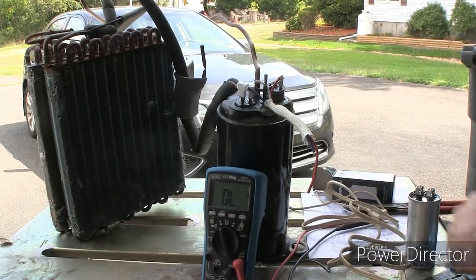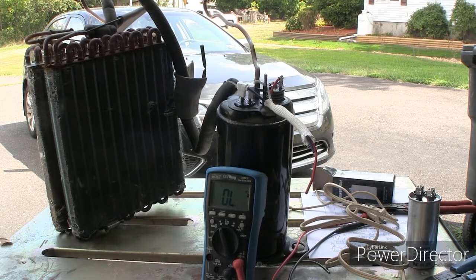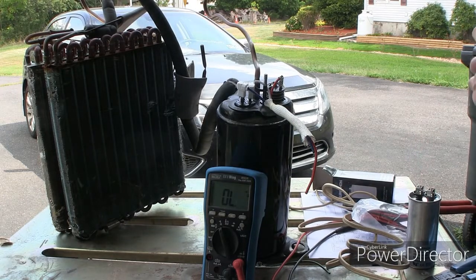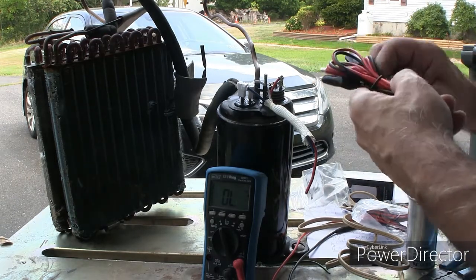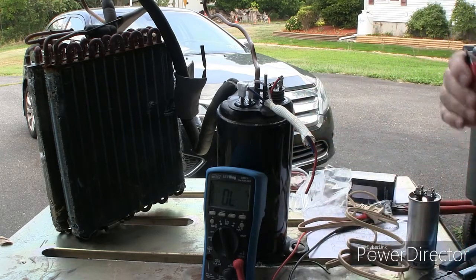Okay, so I've got a line cord here. Of course when we hook this up permanently if it all works out, we will use a three-wire cord that'll be grounded, but for this purpose we know nothing's shorted to the case, so we know there shouldn't be any danger here if we happen to come in contact with it. We'll check that again after we plug it in. We've got some great eBay finds - FTA Electronics alligator jumpers. I've been using them for years and they seem to work really well. I believe these are 16 gauge and even in the winter these don't get real stiff - they're pretty decent silicone for what they cost, very inexpensive.